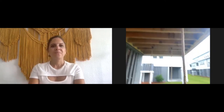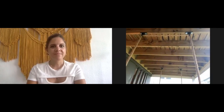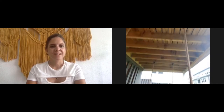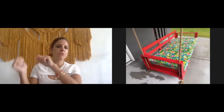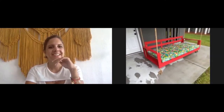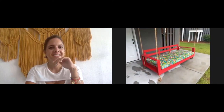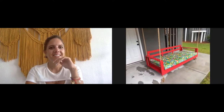I like this system because this particular rope frays kind of easily, and running it up like this allowed me to tie a few knots and deal with less fraying. It still gave me four hanging points. When you put it up, do you put it up with a cord on it, or do you just put them up first and then have the cord run through them later? Let me tell you about the cheat for hanging this — you get yourself some five gallon paint buckets, support the bench on the buckets, then run your rope through, tie everything off, and remove the buckets.